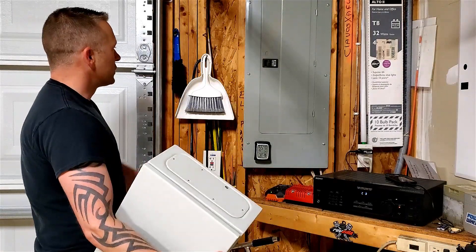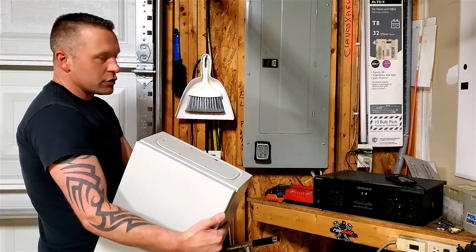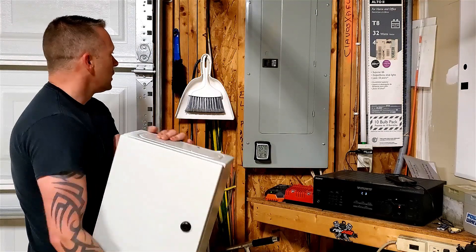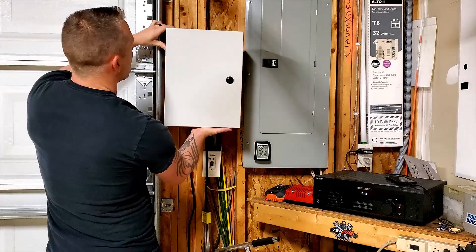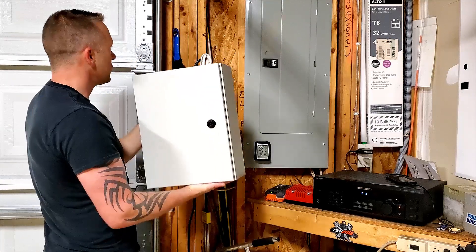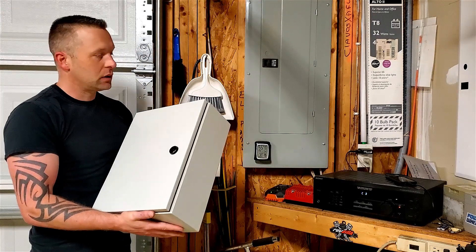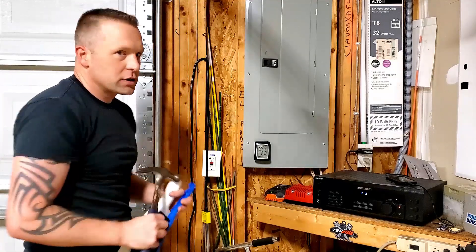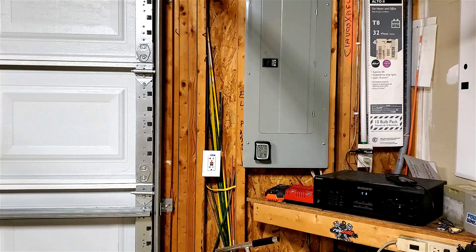Here's where I intend to put this, which is nice — I have my power panel right here for the house. I plan to direct wire this, which will save me a plug on the end and space in the box. I have 12 inches between the standoff stud and the mount for the garage door over this panel. I need to figure out exactly how high I want it and put some two by fours across here to screw into. That little heating element I used to heat my cleaning water with — maybe I won't need that anymore.